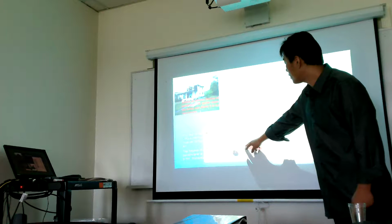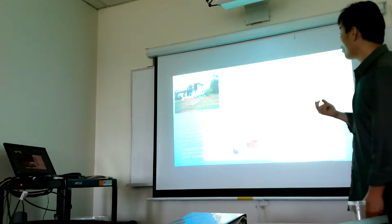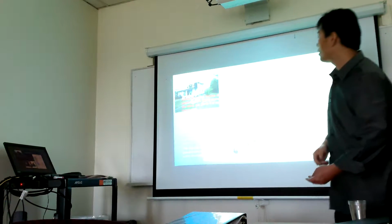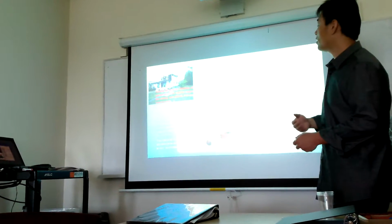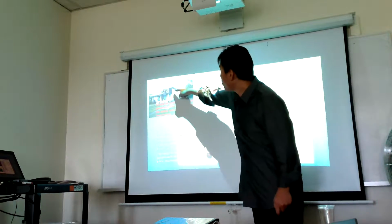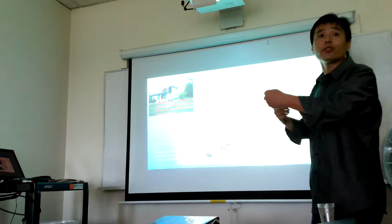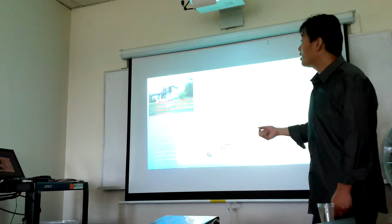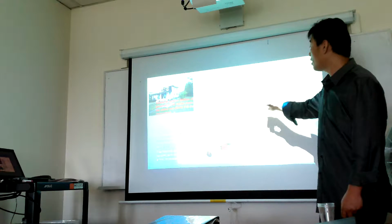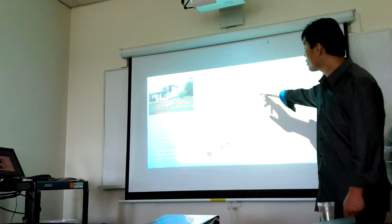Here you can see the very important thing you need to know is the two barriers. One is outside. It's called the air barrier. It's like this. When it rains, some rainwater may penetrate inside, and it drops under this air barrier and slides down. But the air can change from inside to outside, because if there is some vapor inside, you need to deliver the vapor outside. Otherwise it will damage the frame, because the whole frame is made of wood. So that's how it functions.